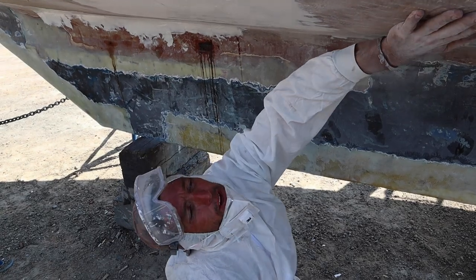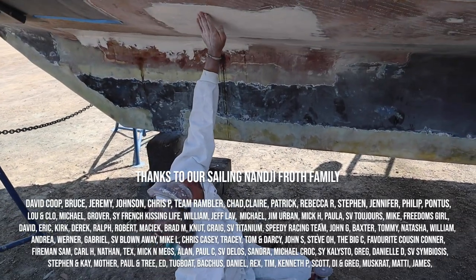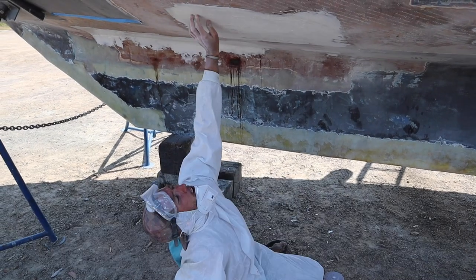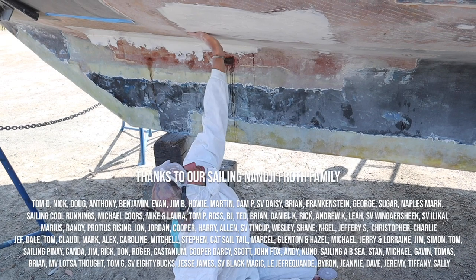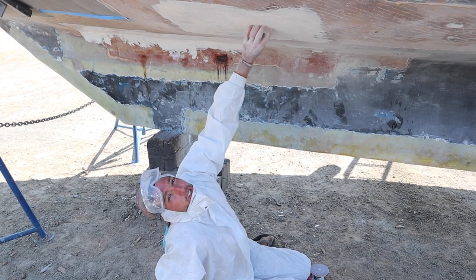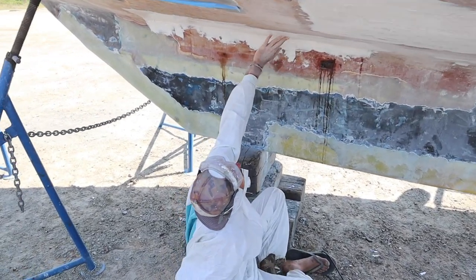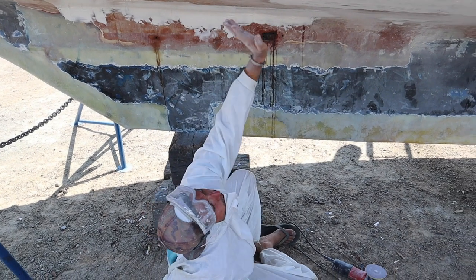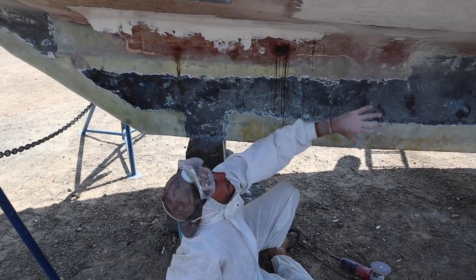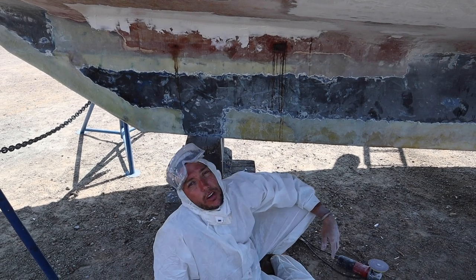All the filler in here was just to raise it up to the same height as the fiberglass, because it was straight wood underneath. So I'm taking all that epoxy filler back to make a nice smooth surface — all one layer, no little indents or bubbles where epoxy can get under when we lay glass on top. Before we glass I'll scratch it up with 40 grit, just give it a hand sand so it's all scratched and the epoxy has something to set to. But first we've got to make it flat and the same shape as Nanji. I need to build it up on the inside here, sand this corner, and then we can put a big bit of glass there. I'll make up my mind once everything's ready to glass.